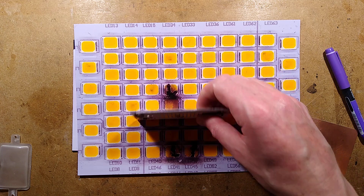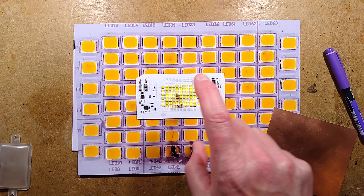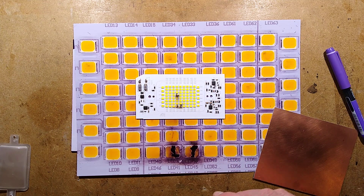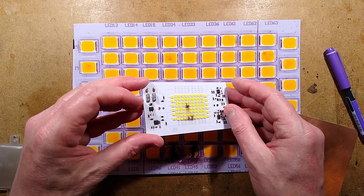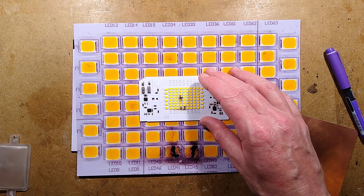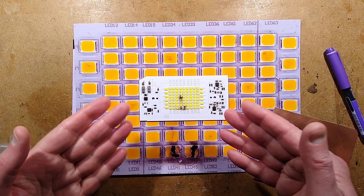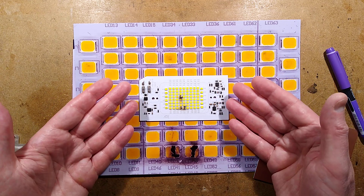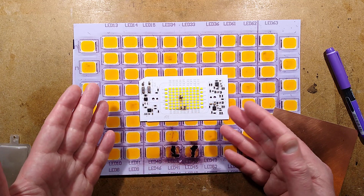This is a real issue. You really have to ground these floodlights properly and make sure there is a solid connection between the earth wire and the case. I do a PAT test at high current, but any continuity test is better than nothing. As time goes on, Britain and America are dragging their heels — they need to update and enforce the use of modern type A or B RCDs in all new distribution boards, to detect all fault scenarios beyond just damaged wiring.